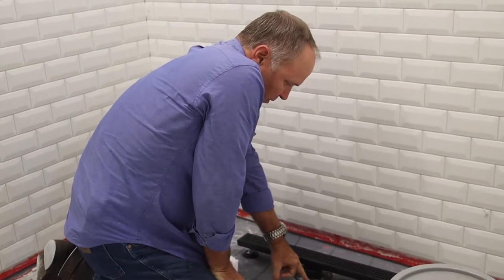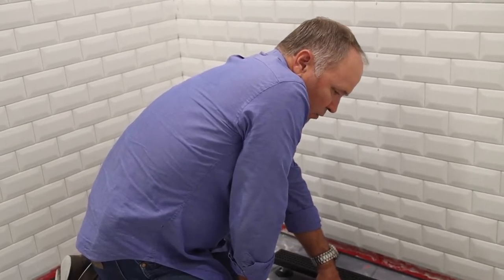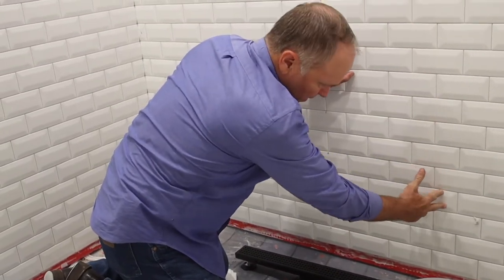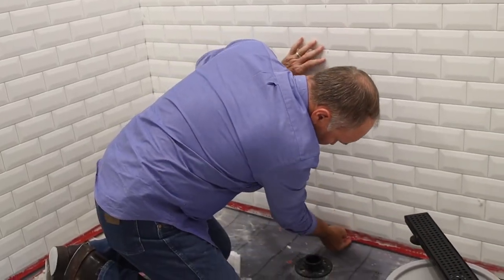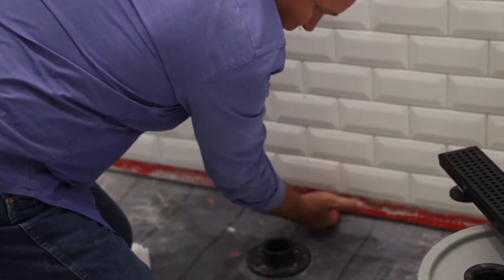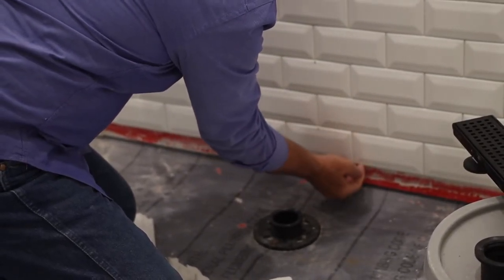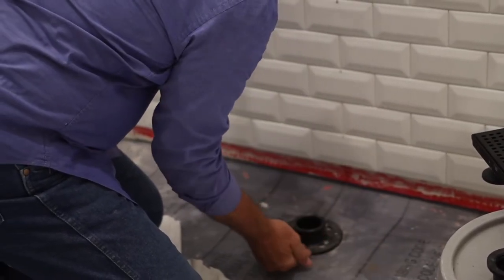Never get one that doesn't have the two-part system that bolts into the actual liner, because any moisture that comes through the tile and gets in on your walls comes down into this pan underneath. This is a flexible one-piece seal — anything that comes in behind your hardy board, which has already had the red guard on it, comes down into here.